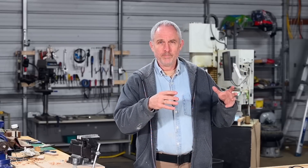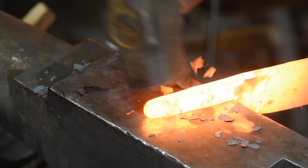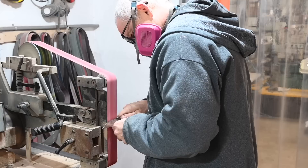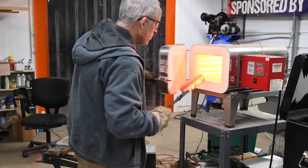I'm going to address the question of what kind of steel to use, but it's important I think for a lot of guys who are fairly early on in the craft of knife making to understand that there's a big difference between how you make knives with stainless steel and how you make it with carbon steel. Typically — and this is not an absolute — people who are forging are going to be using high carbon steel, and people who are doing stock removal will tend to use stainless steel. The main reason is that heat treating stainless steel is a whole different ball game from heat treating high carbon steel.